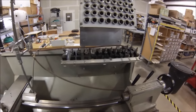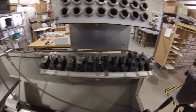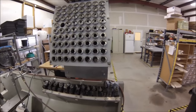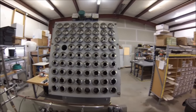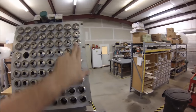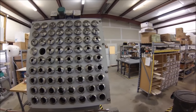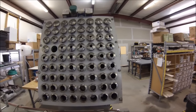I keep all my tools over here on the shelf that I built, hanging from my chip shield — splash guard. My collets are mounted to the back of the machine as well, in sequential order of size. The part of this rack that probably sees the most use is the eighth-inch incremental on the end. Naturally everything else is available, but stock sizes are the ones that get hit the most. All the safety, security, and eccentric collets are kept up top.